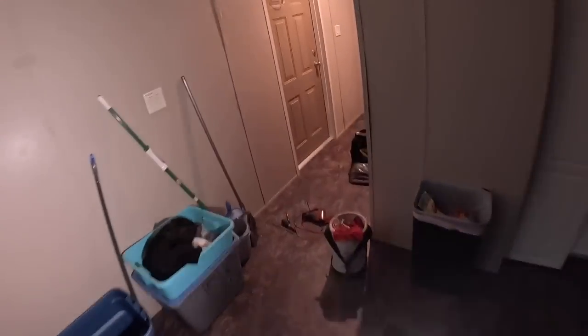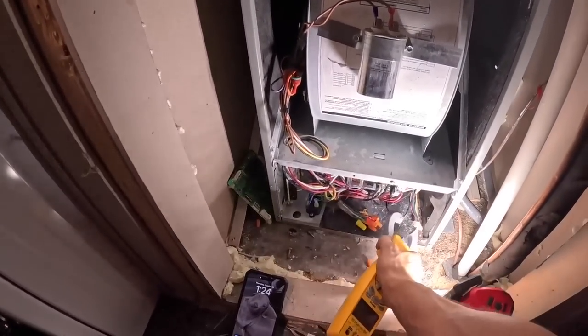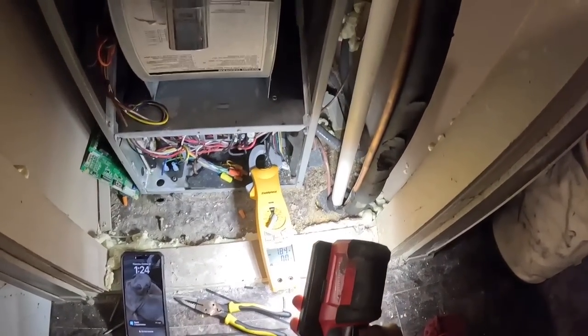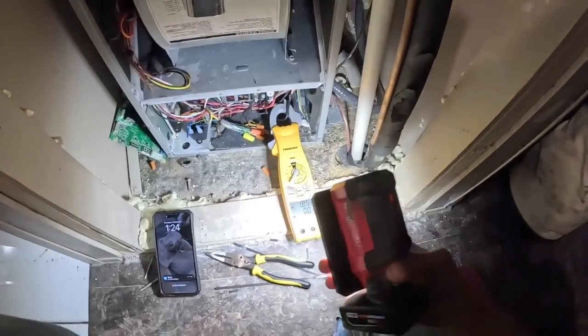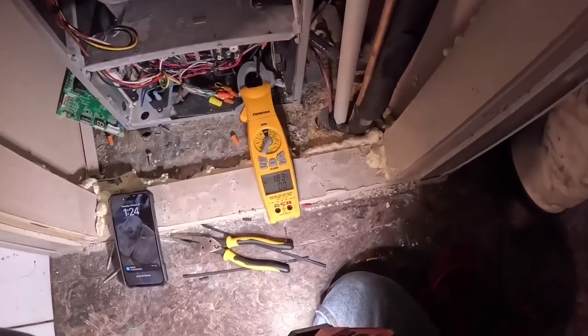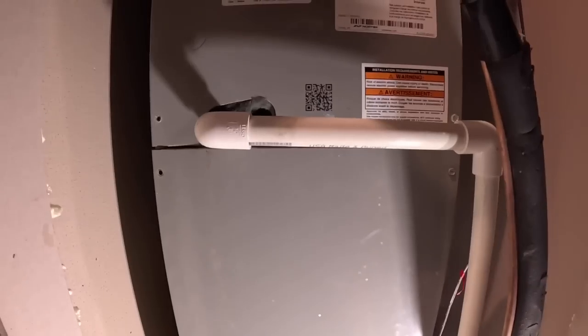Like I can't see nothing. I'm on emergency heat. If I got that wire backwards, it wouldn't come on. Not but 5 kW. All right, I couldn't get the panel on, so I laid the capacitor down on that little shelf that the blower sits on. I laid it down and pushed it up in there and just strapped it there.